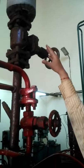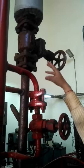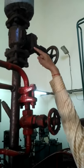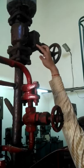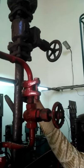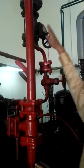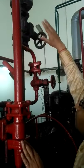On the refrigerant side, there is an insulated line carrying vapor ammonia from the evaporator of the system. The direction has been marked on the valve, so we can identify this as the suction line of the system. The other line is the discharge line of the system. Both the suction and discharge lines are connected to these valves.